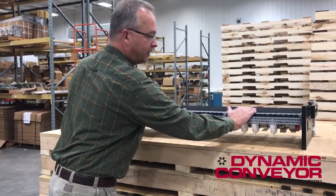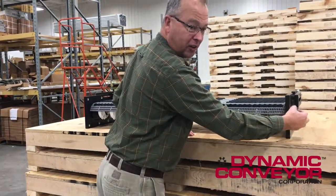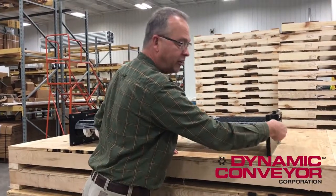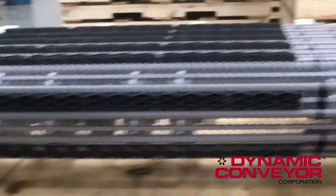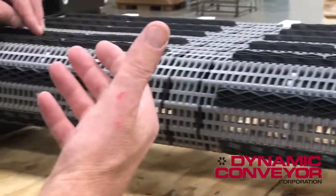Right now I turn the belt just a little bit. Put the motor to the slowest setting possible, then turn it on, and just slowly watch it engage. This looks good. Your conveyor will run smooth and not draw excess load.